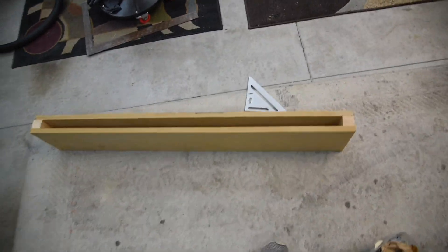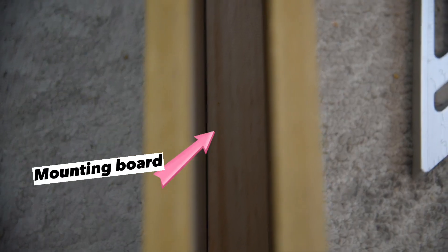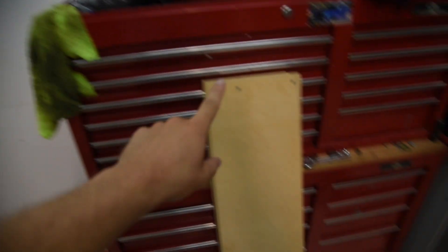Just like that we've got one and two. Now we're going to go ahead and take out this little bar behind it — that's why I made it like this, so it'll still fit in there. That little two-by-two piece goes all the way in there. I didn't screw that in so I can take it out. See how this one's completely hollow? That two-by-two board is getting mounted onto the wall and then this guy gets put onto it — it's a floating shelf, you'll see what I mean.